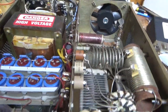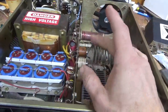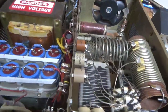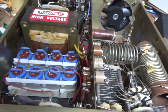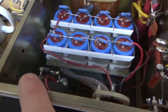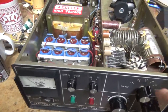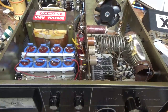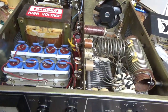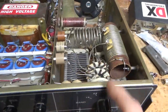One of these doorknob cap values was off — I have to go back to the schematic and change it, because he said two had popped and he replaced them. The air variable caps look okay. He has meter protection diodes. I'm going to go through the rest of it and I'll report back when it's all done. The band switch looks okay too.